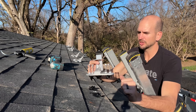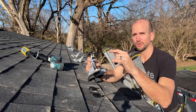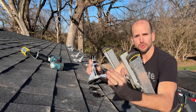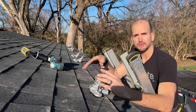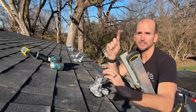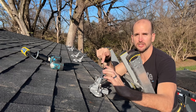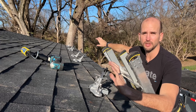Now that might be a concern, but we actually do load these up with sealant to make sure those four lag bolts that are sinking in are not going right to your truss. Conventionally when doing a mounting system, each mounting point would have a lag screw going in and securing to a truss — usually about two and a half inches sunk in. Then you would put a rail on each of your mounting points.